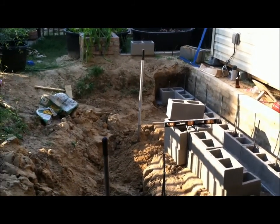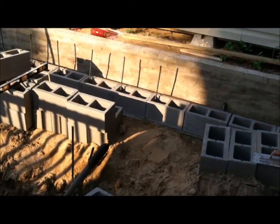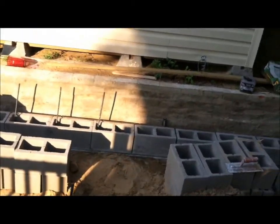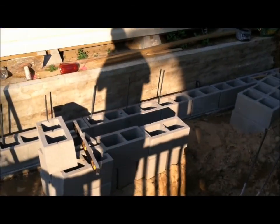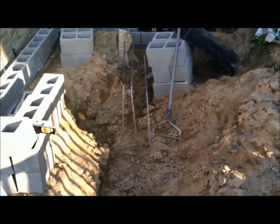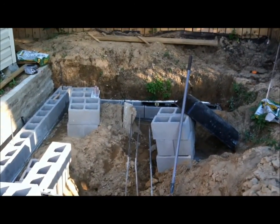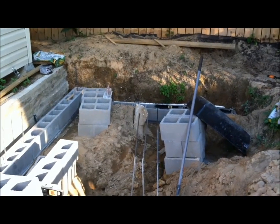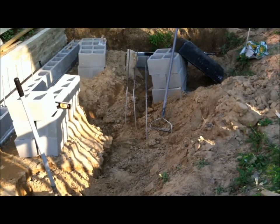I plan on going about 6 foot deep on this, maybe a little deeper. Definitely going to have straight walls along the side for at least 3 feet, maybe 4 feet, and have a heavy taper slope bottom. Was thinking I was going to put one 4-inch bottom drain, but depending on what everyone else says, I may put two 4-inch bottom drains, or maybe just two 3-inch bottom drains. Definitely want to do the aerated thing.